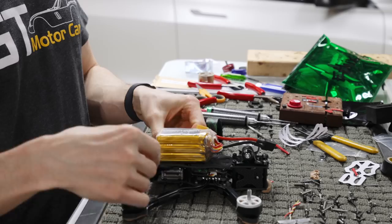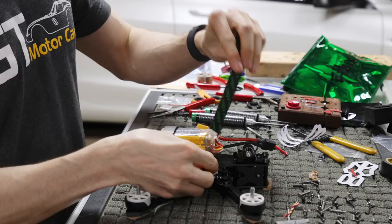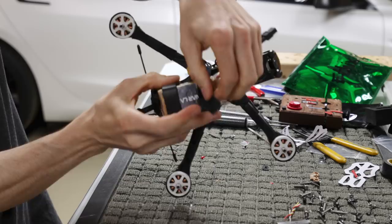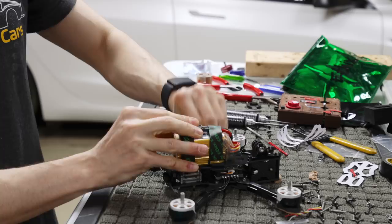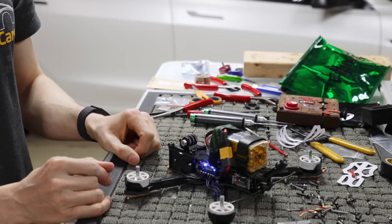But the reason I do this is, one, I always go with the back strap first, and then I crank it down like that. 230 mil fits perfectly over that battery, which again, is specific to the batteries I use. And then this 250, the reason I do it like this is it gives me some opposing pressure, so I'm not always tweaking the battery one way. Now I'm pulling it back this way, and then I get it started, and then I run the battery lead underneath like this. And now when I plug it in, my battery lead is tucked super tight to the airframe, and it's not going to go anywhere. And when I want to undo it, if I needed to get to it in some kind of emergency, I just pull this one tab, and now it's loose and I can pull.